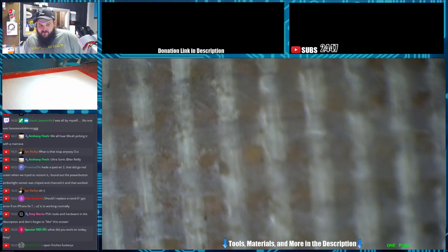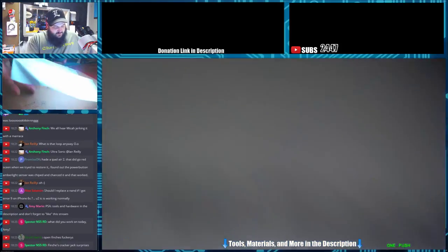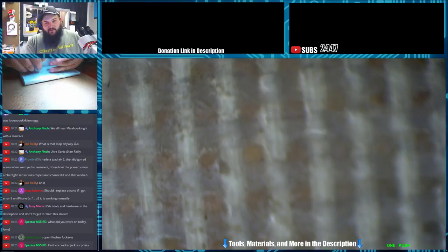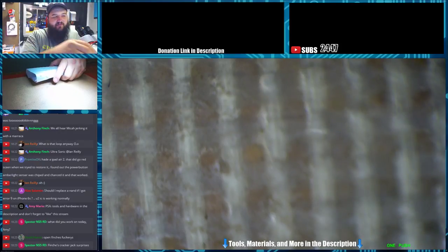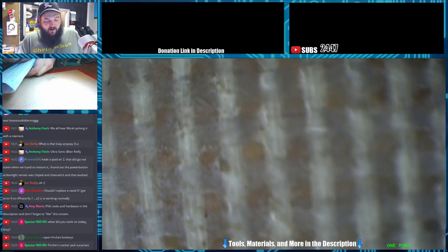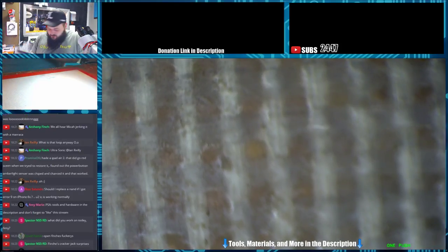Open up Finch's fuckeries? Okay, I'm done with all the other ones, so. This one was... I'm not going to charge them for since evidently it was my fault. I did a backlight repair on this one, and somehow that damaged the audio IC on the opposite side. Other side of the board, opposite side from where I was working, and the side directly under where I was working didn't have any solder balls, but evidently I caused it.